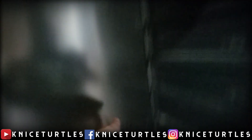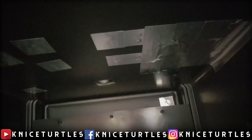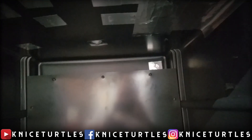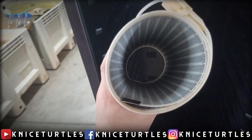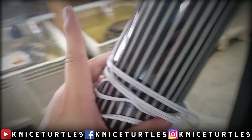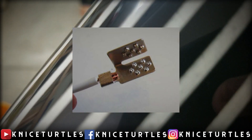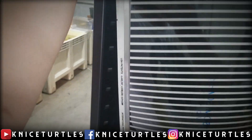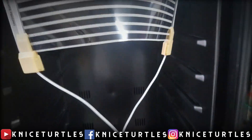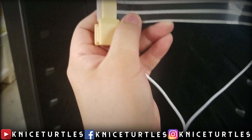Make sure to cover every single hole because you don't want anything to mold the insulation inside the walls. Once you've gutted and sealed the refrigerator, the next thing is the heat tape. This is Flex Watt heat tape, usually sold by the foot, with the cord sold separately — so you need to buy both. I bought six feet of heat tape originally for that mini fridge, but six feet happens to be enough for this fridge too. The cord has two clamps that connect to the silver strips on either edge of the heat tape, which requires pliers to clamp down so the metal penetrates through the plastic and touches the strip inside.